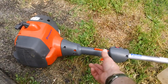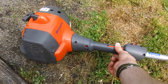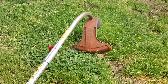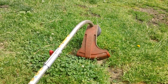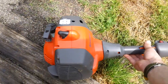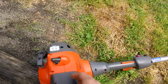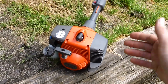That thing's still a little cold — it just got done starting up and it's been sitting overnight. Everything's working good on here. The bump head trimmer is spinning fine. Make sure it stops — there we go, it's stopping. It should not be spinning while the machine is idling. It looks like it's working okay. Sounds good — it's got a nice smooth idle and doesn't have any weird loping or knocking. It's ready to go back to the customer.